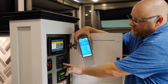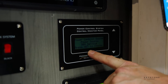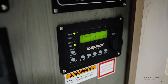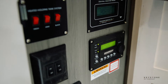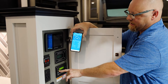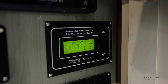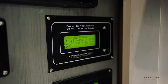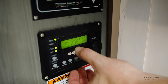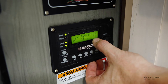Second thing: if you look up here, this went from 25 amps to 30 amp service — inverting, but you see the power was interrupted. My charger light came on telling you there's still power available, but the voltage wasn't very good. So that's going to go, and again after about 20 seconds, that'll kick over to charging. Here's what has happened — we don't have good power, so I'm load supporting. That's one of the features of this inverter: I have okay power but I don't have great power, so I'm helping run loads.